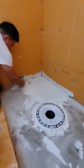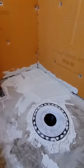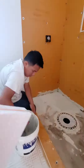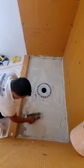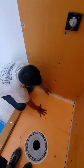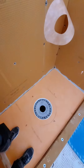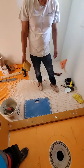Now we're going to spread thinset all over the shower pan and up the wall a little bit so that anywhere the shower tray comes in contact with the pan they'll have thinset — any areas where there's white needs to have thinset. Now we're going to insert our pan. Add in a little piece with a little thinset on it. That's what I like to call the Schluter shuffle — basically you just ping one foot around; everywhere you'll feel the little bubbles popping under your feet.